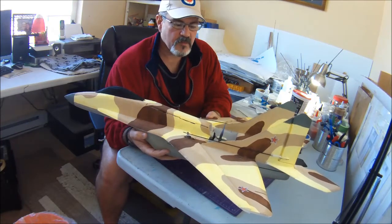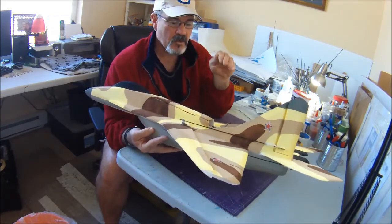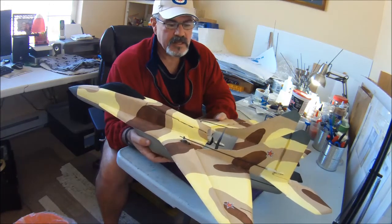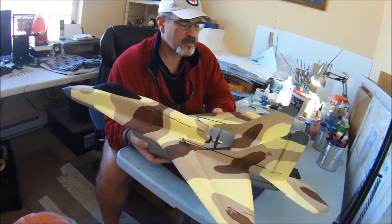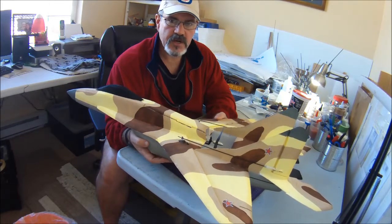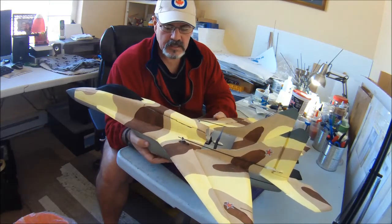If speed is not really important to you, that's fine. But what that says to me is, if my plane can go that much faster with the same motor, then just cruising around, I should be more efficient, and maybe have longer flights. And the plane also just feels a bit more slippery through the air. And normally a good sanding job, I found, reduces the weight of the plane by half to three quarters of an ounce in total over a plane that's not completely sanded.